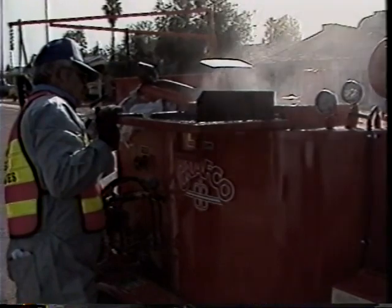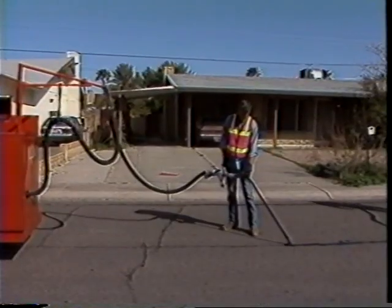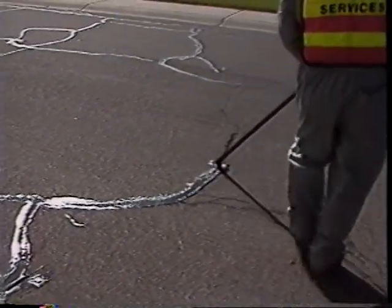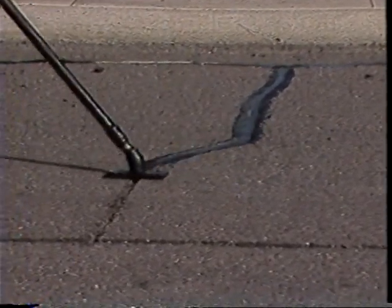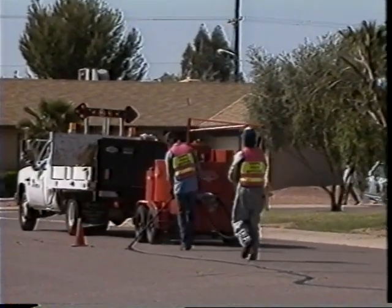The Craftco EasyPour Diesel Melter applicators have been designed for years of quality service. Make sure that you are thoroughly familiar with the procedures for starting and shutdown of the machine. Always clean out the machine completely if you change the brand of sealant material, and never mix brands or grades of sealant. Please refer to the owner's manual for additional maintenance and material specifications.